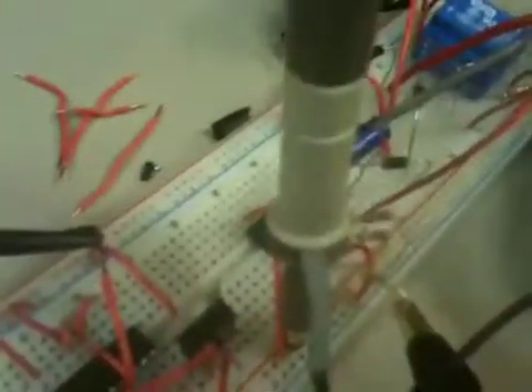The last thing we're going to check, if my multimeter doesn't die, is our 5-volt power supply. This one is actually only used for the frequency circuit, because the Arduino is powering most of the 5-volt stuff, like this backlight right here. It's actually reading 4.4 volts, so I'm a little disappointed on that. But we have a swing of 2.2 volts, and I've been powering the frequency circuit off that and it seems to work okay. The 2.2-volt swing means we're going from about 3.4 to 5.4 volts, and the range on the LM is 3 to 6 volts, so we're perfectly within range.